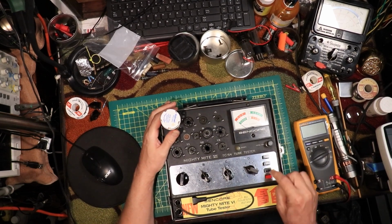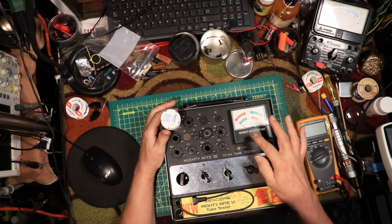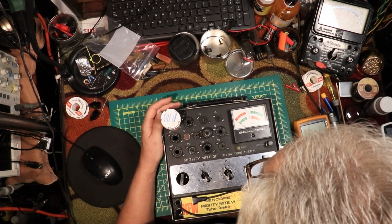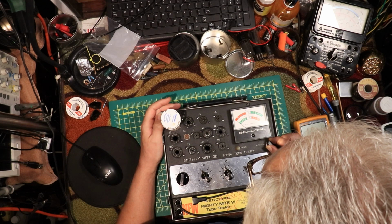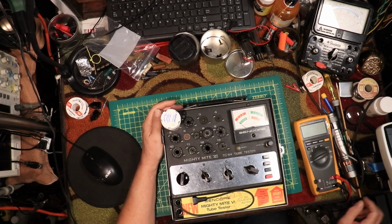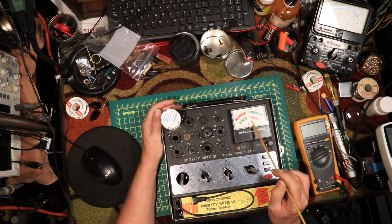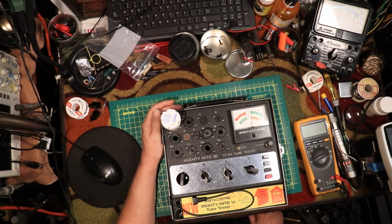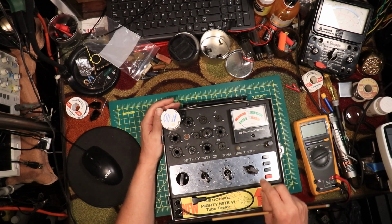Let me see. Turn it off, and that's pretty close. This needle's laying, so I don't have to do the meter zero, just adjust to here. So again, put it on shorts. It moves, so we'll put that on zero. Zero that out. Okay, now in this position, the needle should go right here on the bottom scale, that's the question mark for the bad, right at that line there for the grid leakage. And we'll look, and it's spot on for emissions, grid leakage I mean. So that's good. Put it back on shorts, then we put it on C.